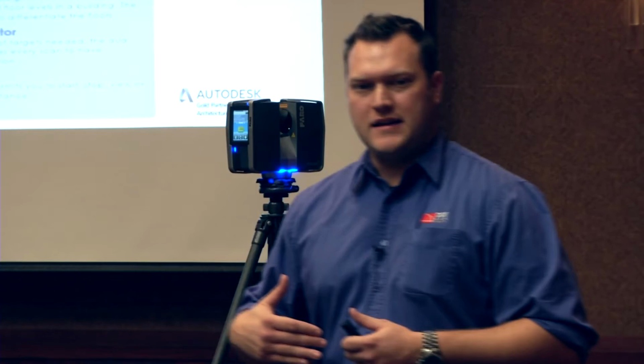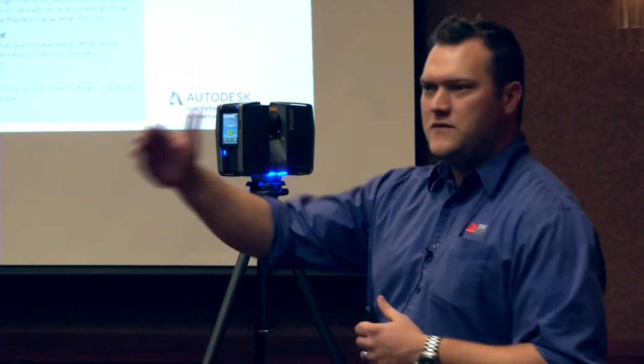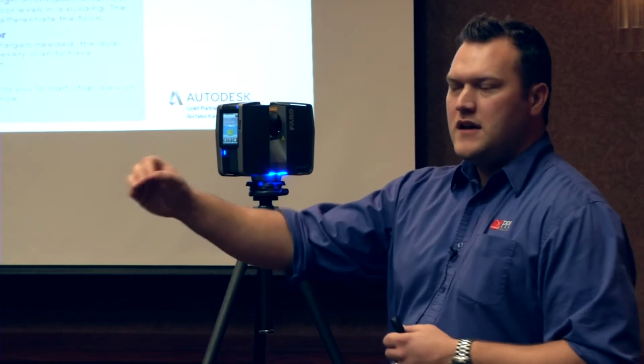so it's not time of flight. So in phase-based, it actually sends out a wave of light versus a pulse of light. So a lot of scanners out there will actually send out individual pulses, individual shots, if you will. If anybody's ever used a reflectorless total station, it's the same kind of technology.